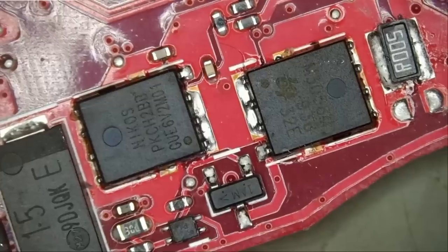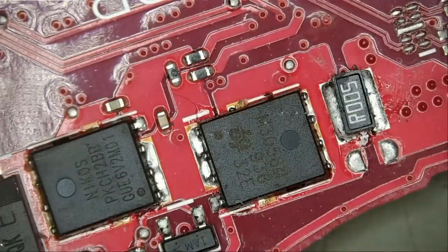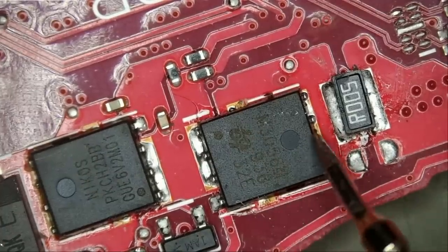And right now, I'm gonna inject voltage at the short, and we're gonna monitor the board under a thermal camera and see what gets hot on the board. And then maybe, just maybe, I'll include one more Asus repair in this video, if possible. And right now, I'm gonna inject 1.3 volts at the drain of the MOSFET. Go to our thermal camera.